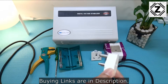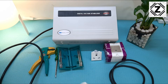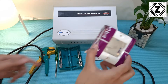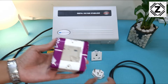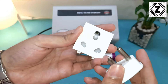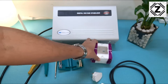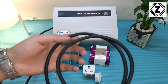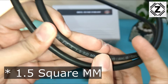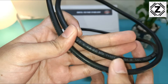For the output section, I'm very disappointed with the bare-wire terminal, so I'll use this kind of surface board - a simple sealed board. In this surface board we are going to install a 6 by 16 amp socket which can take both 6 amp and 16 amp plugs. The socket will be installed in this board to provide the output. I also brought a piece of wire - make sure you buy good pure copper wire. This is rated at 1.5 square mm, which is perfect for fridges or washing machines.